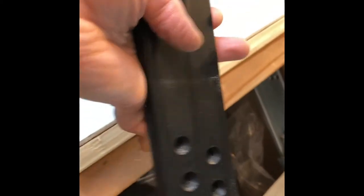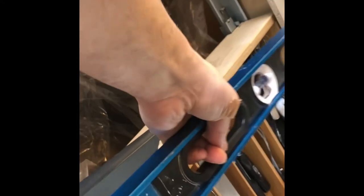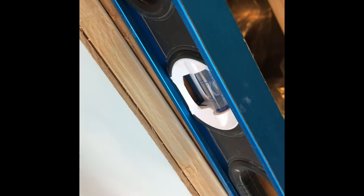How do you install these? What are the holes in the back for? Those are for screwing up against the two-by-six that I'm putting in there. As you can see there's not one in here yet — I'm putting it up against that and then I'm going to secure it well. Make sure you use a leveling bar and clamps. When I put the leveling bar up against this I'm going to lift it up just a hair so it's up, then mount it and make sure everything is level to the back.